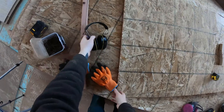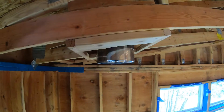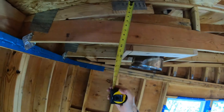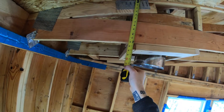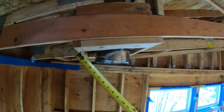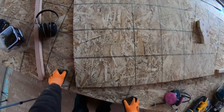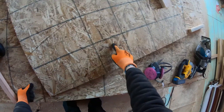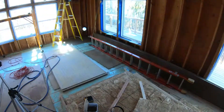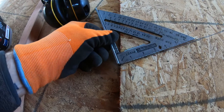Here I'll show you how I laid out the side piece that's going to go on there. It has an angle on the top and an angle on the bottom — it's an awkward piece. I measured roughly; it's basically around 12 inches on this side. I know this is a 2/12 pitch and this is a 4/12 pitch. If I know one side and I know the width — it's about 19.5 plus half an inch on each side, so 20.5 — I'm down to my OSB. I got 12 inches here and 20.5 there, and then I drew a 2/12 line here and a 4/12 line there. I'll cut it out and it should fit.